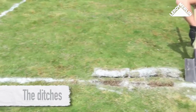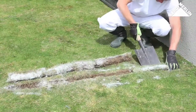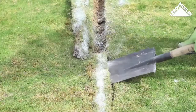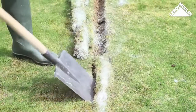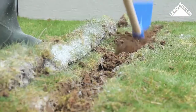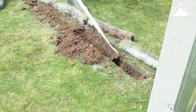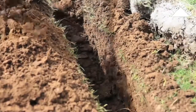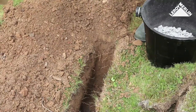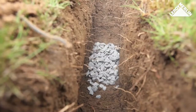The quickest way of concealing the 10-centimeter-wide ditches is to remove strips of turf and lay them on the soil so they are easy to replace. Dig one side of the lawn with a spade, then remove the turfs on the other side. Use a weeding hoe, then a rake over the bottom, and remove the soil with an adze. For safety, the ditch should be at least 20 centimeters deep, leaving an extra 5 centimeters to accommodate the sprinklers, valves, or taps. Then sprinkle a 5-centimeter layer of gravel to help the ditch drain.